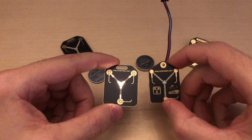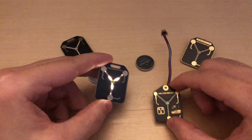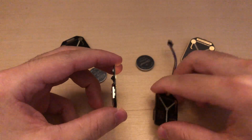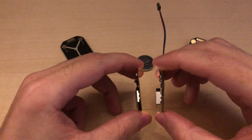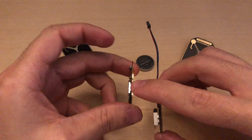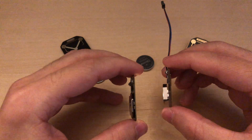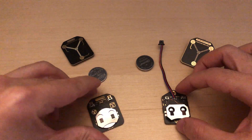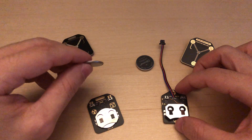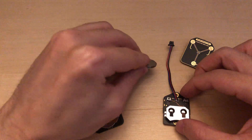Compared to the older one, the newest one is about four millimeters wider and about the same height, but one of the main differences is the thickness. The newer revision is almost half the thickness of the old one. It uses a 0.8 millimeter PCB instead of 1.6, and the battery holder changed as well. The newer revision is compatible with a CR2016 battery, while the older one used a CR2032.